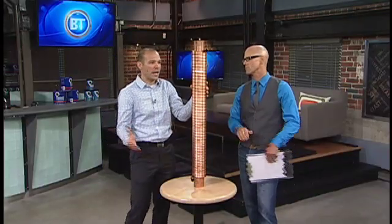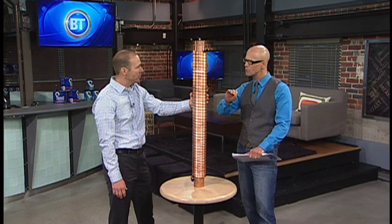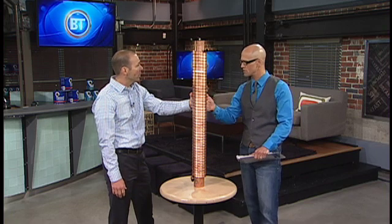To translate that into money — a typical electric water heat customer would spend about $280 a year to heat their water. This would save you about 25% of those $280, and that's for a typical household in Manitoba. That 25% is pretty good, and it can be used on any kind of hot water heating, whether you're electric or gas. The drain water heat recovery doesn't care what kind of water heating system you have. Obviously if you use electricity to heat your water, which is more costly than natural gas, you'll save more money because your water heating bill is higher.